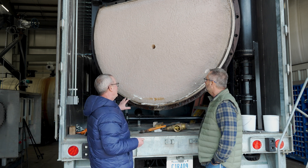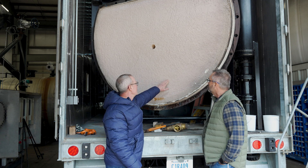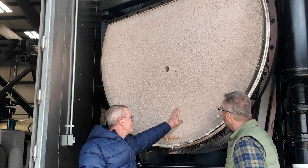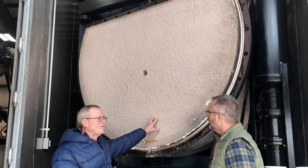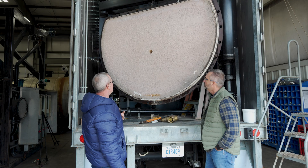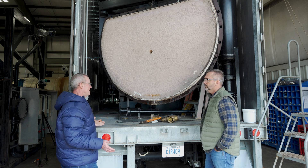There's a whole bunch of things to deal with that. One — people like to make the door slick like you do your concrete, they want it slick. You don't want the door to be slick, because that flat sealed surface seals the refractory and water can't get out. That water's got to go somewhere — it needs to come out. You need to bring it up slow. It's going to take two days to cure that door. You just have to do it.